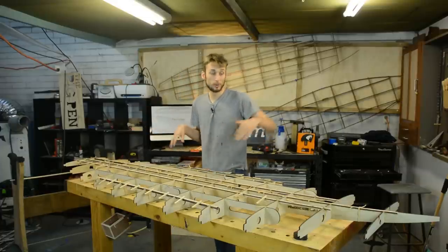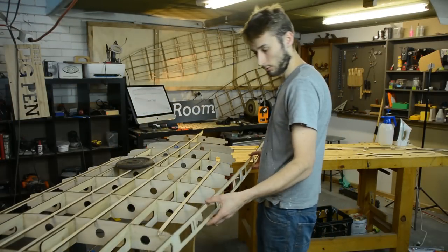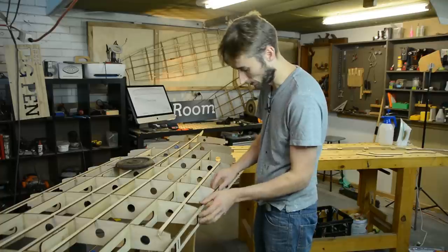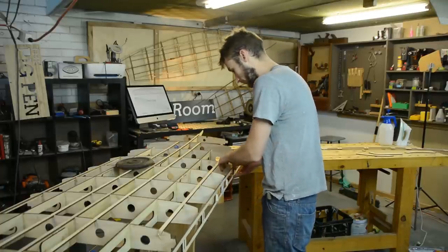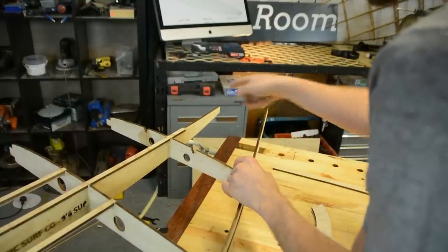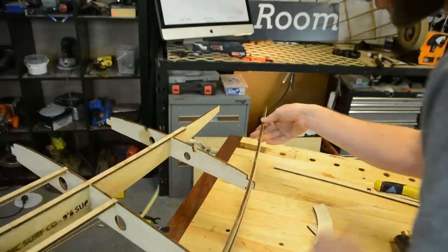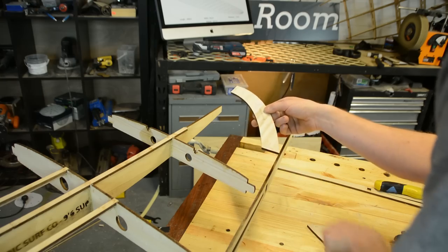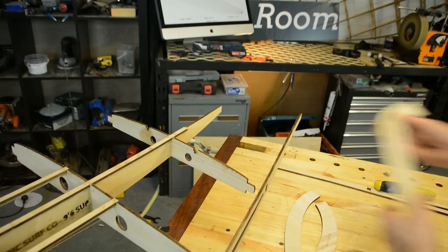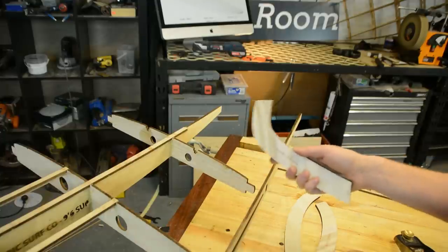We are super close to moving on — all we have to do is install the rails. The rails slot onto the frame so the slot numbers line up with the corresponding rib: one at the tail, eleven at the nose. There is one little issue at the nose: if we try to get the nose section to bend around and meet the actual nose tip it's going to feel really difficult and the timber may snap, because we're working with solid timber that has grain direction. In the kit you'll have noticed a couple of bending forms — two labeled with the nose go either side — and there are also forms for the tail, for those who want to block in their tail with a hollow strip instead of a solid block.